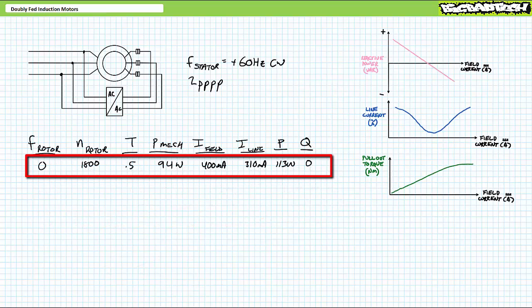As previously, I first get the motor rolling in a traditional synchronous mode with pure DC on the rotor and fixed frequency AC on the stator. As can be expected, the rotor turns exactly at 1800 RPM. Then lightly load the motor with 0.5 Newton meters of counter torque. Given this is synchronous operation, the rotor remains turning at exactly 1800 RPM.